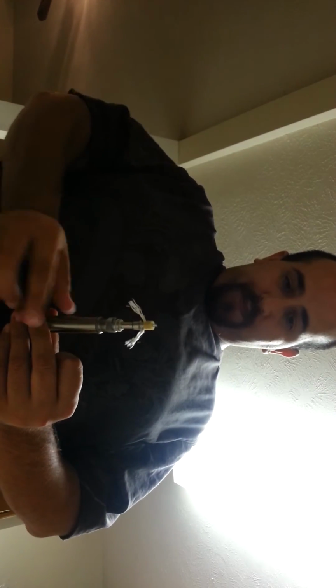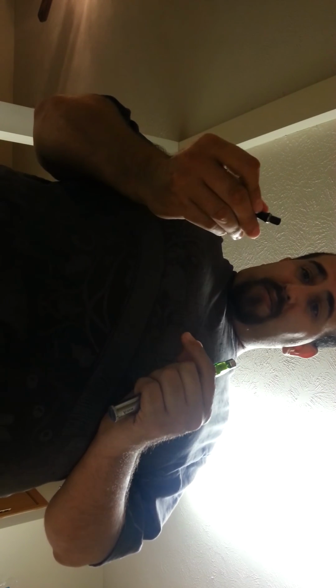Wipe it off. You've got everything on your battery, or you've got your atomizer on there. You've got the little metal nipple. You've got the little rubber condom thing going on. You've got both your O-rings right there. Slide it back on. I always find it's best to take a Q-tip with these and go through it just to get whatever out of it. Make sure that you didn't lose that little rubber O-ring. If you lose that, unless you've got something laying around or you've got another Clearomizer, you're kind of screwed.